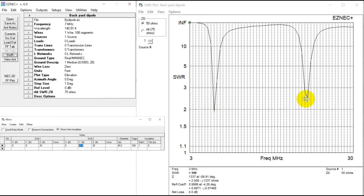The elevation pattern is a little unusual because this is a low antenna, but what I want you to notice is what happens on the other bands. This will not tune 3.5 megahertz at all. It will not tune 20 meters or 30 meters — they're way up here — and it won't do 17 meters, but it will do 15 simply because it's the third harmonic, an odd harmonic. Then it goes back up here for 10 meters, which is right in this area. 12 meters is somewhere over here. Note that most of the frequencies here the antenna is out of tune and will not respond.